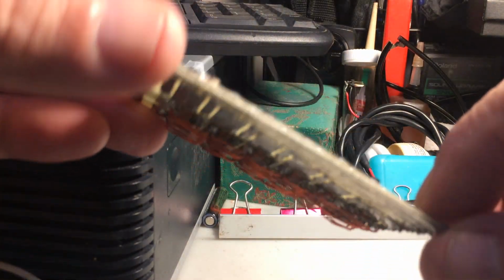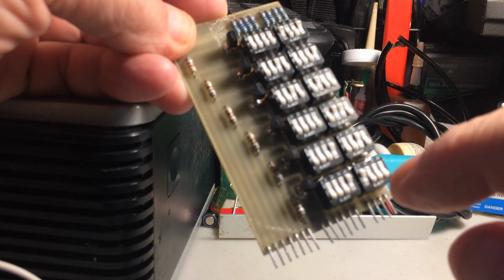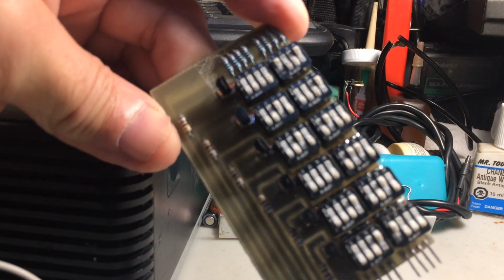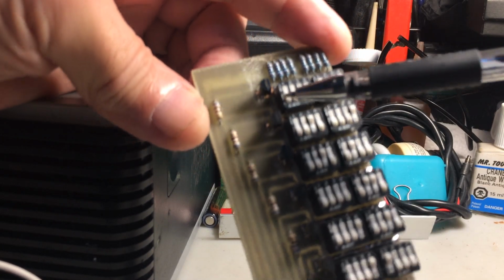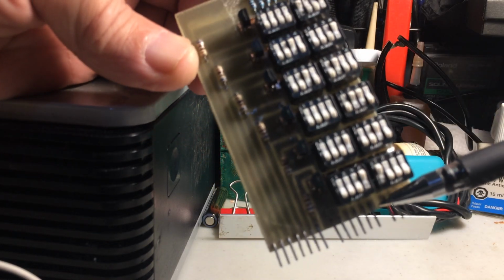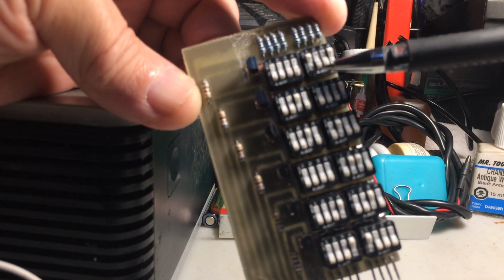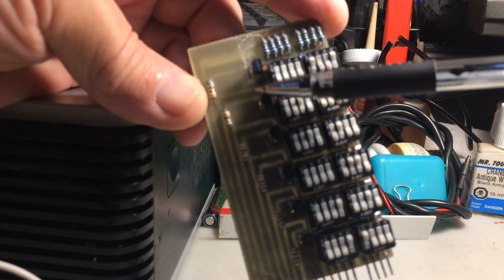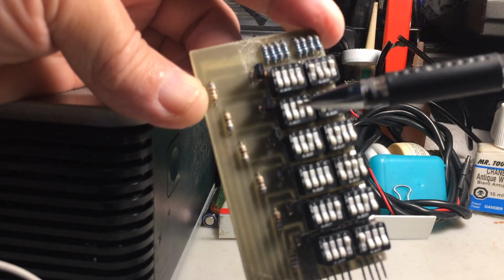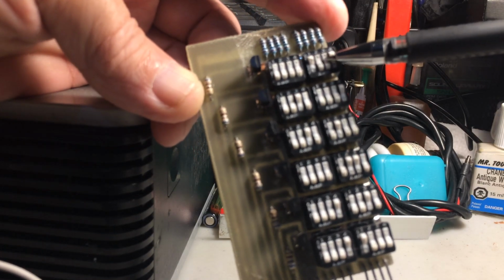And one thing about this I wanted to mention also, that this EPROM is not made to separate the low order bits from the high order bits in order to select your row and column. It doesn't work that way. There are no column selects on this EPROM. This is just row select. So in other words, whatever data is set on these dip switches is the exact data that's going to be coming out every time that row is selected. Okay, there are no circuits in here to select columns. In other words, individual bits cannot be accessed. What you're doing is accessing the entire row, because there is only one transistor that will activate that entire row. Okay, and the data output is dependent on which of the switches are grounded or are closed to cause a ground condition.